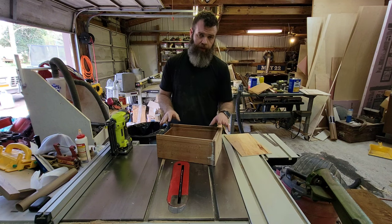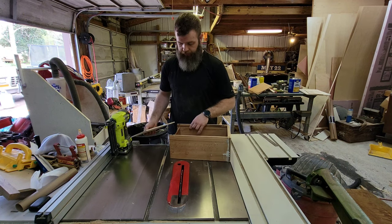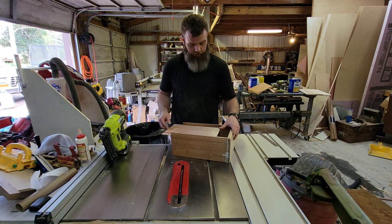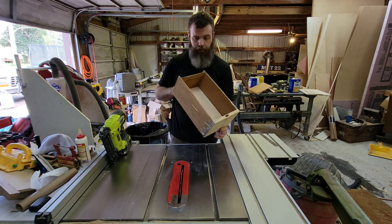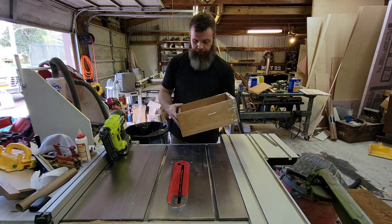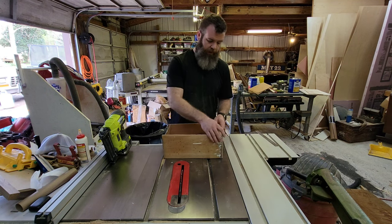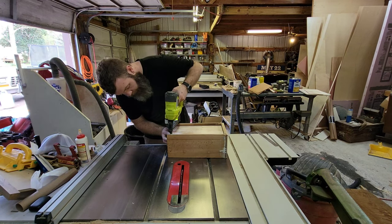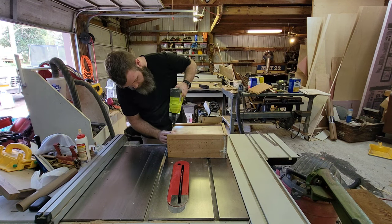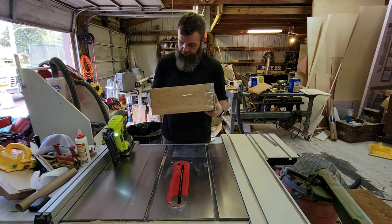So that's all our plywood pieces we've got to cut, and then we'll work on those feet. Okay, so the final thing we need to do before we actually start painting it is I cut some replacement panels. You remember how nasty these bottoms looked. So what we're gonna do is slide them in place like that. I'll put two little short brads in to hold the rear in, and we'll have nice, clean inside drawers. And we're gonna clear coat all these just because they'll have clothing and stuff in there. So we're gonna paint the fronts white and clear coat all of it. So I'm just gonna put these in. That's it. So just gotta do all the rest of them.